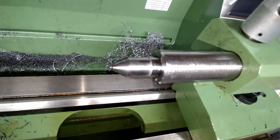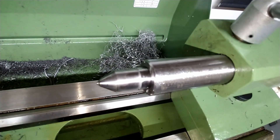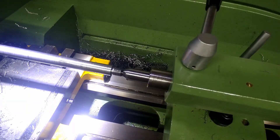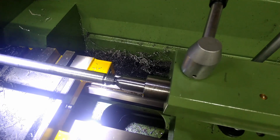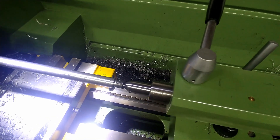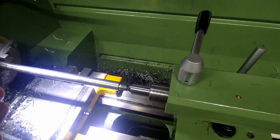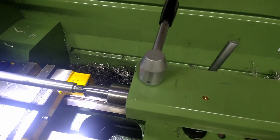Today I found out what happens when the dead centre runs out of lubrication — it wears a groove in the end and your part starts having a really bad surface finish. Remember, I did this so you don't have to. So I put a new centre in, but the hole or taper it was seated in had also worn away and it was wobbling all over the place. The thread was over length anyway, so I moved it back to the chuck, cut it down to length, and used the centre drill to put a new hole in it and extended it out.